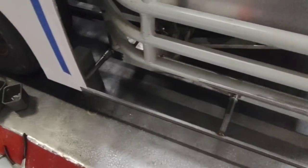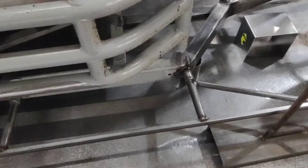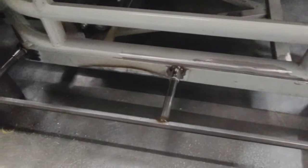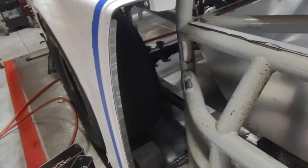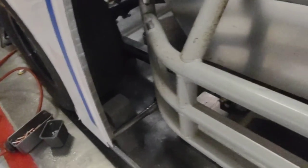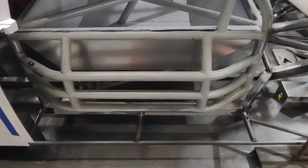We now have the lower door support welded up. I haven't drilled the bolt holes yet — I'm going to wait until I'm finished so I can reset it exactly where I want it. I did add the little kicker bar gusset to the front. Now I'm ready to put the nerf bar in. I also added the seam support for the door-to-quarter seam, so I know I've got the correct roll and it'll match my door and look good compared to the right rear tire.